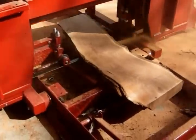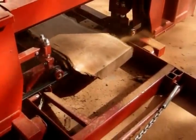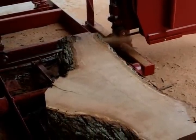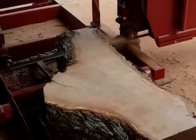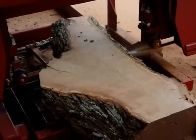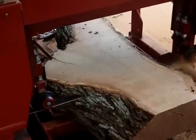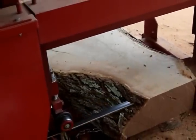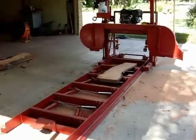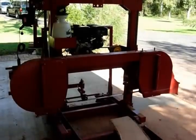Now you've seen a video of my mesquite cutting sawmill version two. This one is much stronger than my original one, much more accurate, and it's not a difficult saw to build. You need a metal cutting band saw - the 64 and a half inch horizontal band saw - a good welder, and a drill press, and it can easily be made. By embedding the bearings I used a lot of fancy things here, but you could easily use pillow blocks and flange bearings to substitute for those, which would leave only a small amount of machine shop work requiring a metal lathe. I plan to have plans available shortly on eBay that cover the details, which are just too numerous to cover in a short video. I hope you can build one and enjoy it as much as I've enjoyed building this one.